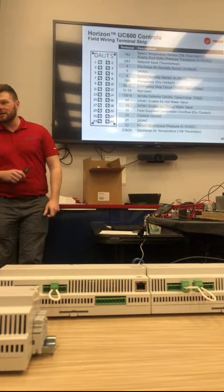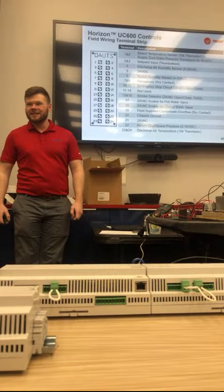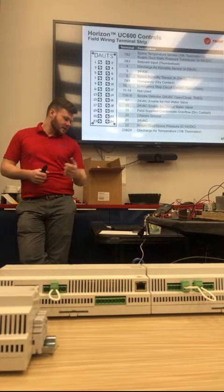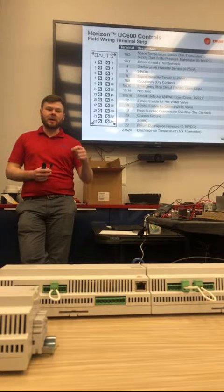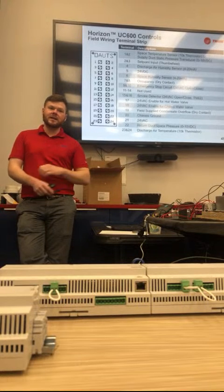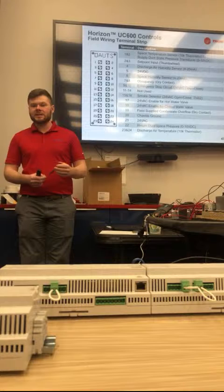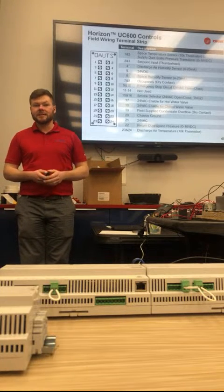I took it off, and Jimmy gave me a really hard time until I finally added it back, because I guess you all complained about it enough that he got tired of hearing it. So basically for discharge air control, we still wire those wires with the space sensors on there. And the wiring diagram is built per unit. So the wiring diagram, for what you see in the unit, is specific to just that unit. If it's on the wiring diagram, it should be in the unit. So if you're wondering whether those wires are there or not, you can always pull up the wiring diagram and see it, whether they go to the older board from the XM70.